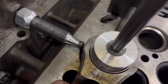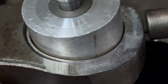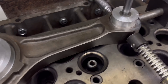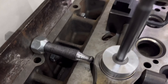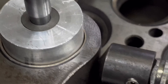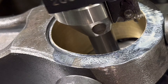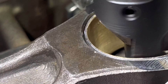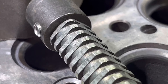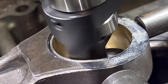I'd have to guess — that's just side to side. I think that's more than 10 thousandths so it probably won't touch it. I kind of want to flip this rod over — the fixture works pretty freaking good. I can hand thread these two and adjusted that gap there. This rod is crooked so it's turned into an R&D rod now. It shouldn't cut really anywhere because it's like 3 thousandths shy. Let's go a little faster, clean it up, and see where we're cutting.